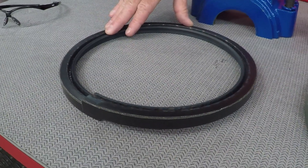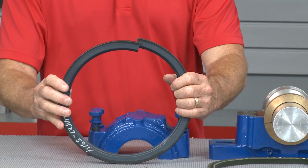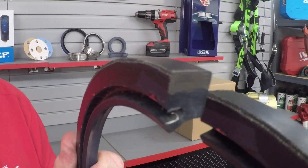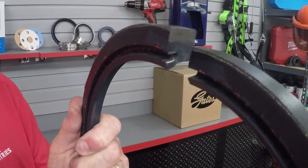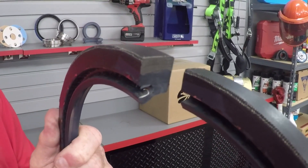Now although a retaining cover plate is not really required for the Model 26 — which is right here — it is recommended that one be installed. When you need a higher performance solution with better bore retention, the Closure Model 26 seal is a great option. It's got a fabric reinforced heel to improve bore retention, and it's available in single and dual lip configurations. Plus, the stainless steel finger spring is molded right into the design, which prevents spring dumping and the associated catastrophic bearing failure.